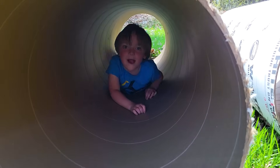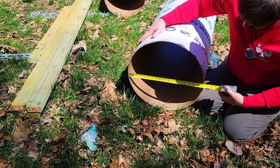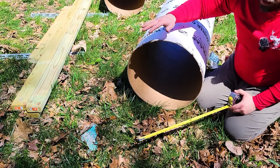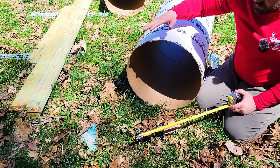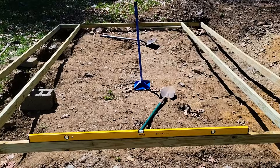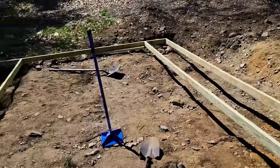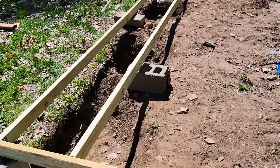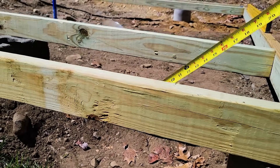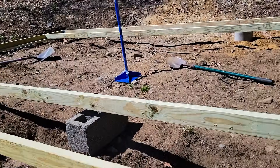We'll cut this up and lay it in. I'll add a few more 2x4s for blocking and stabilizing. This particular sonotube has an 18-inch inside diameter - they might be a little bit smaller, sometimes 17 and a half inches, because they'll sleeve some inside the other for shipping purposes. But this happens to be an 18-inch inside diameter, so it's 18 and a half inches overall. I've gone back and forth and we're pretty level all the way around, so that will allow me now to measure the height. What height do I need to cut the sonotube at? We'll go 20 and a half on this one.